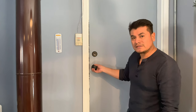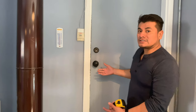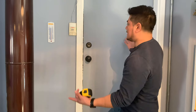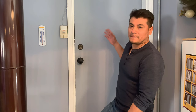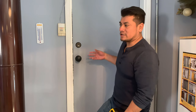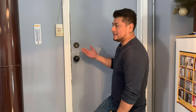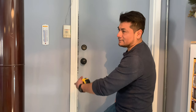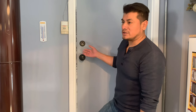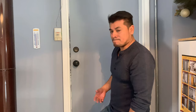One thing I haven't mentioned yet is the way the door swings. When you're viewing your exterior door from the outside, wherever your hinges are determines the swing. If your hinges are on the right, you have a right-hand in-swing door. If your hinges are on the left, then you have a left-hand in-swing door. If the door swings out, then you would just have an out-swinging door.